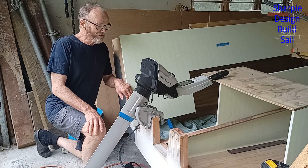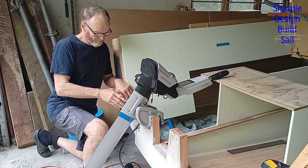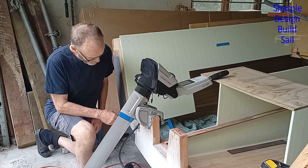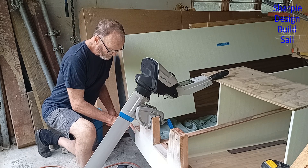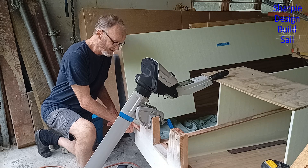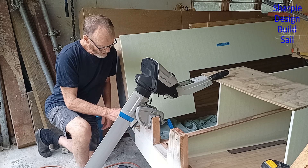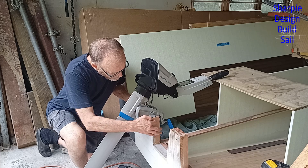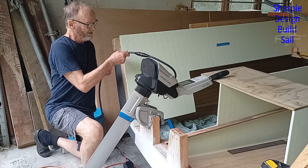This is a really good time for me to have a look at how the outboard setup is going to function in this position — what I've allowed for and not allowed for. My first thing I'm looking at is this footprint here where, when I get out of the dinghy, I want to be able to stand here, and it's barely wide enough at the moment, especially if you have shoes on. So I can probably trim down the side here a bit. I also want to put bolts through here so I need to drill holes and bush those like I'm going to do here.